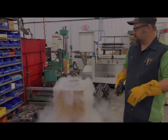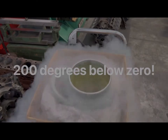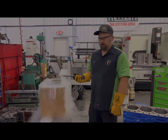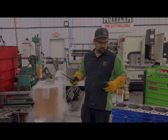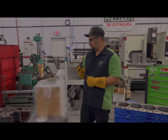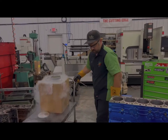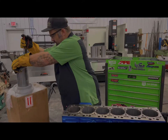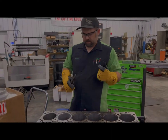When you're taking a room temperature part and putting it in liquid nitrogen, that's about 180 to 200 degrees below zero — that's just the reaction from the temperature difference. But what that's doing the whole time is shrinking the sleeve as much as seven thousandths of an inch. So we've got one to one-and-a-half thousandths press fit, we're shrinking that seven thousandths — do the math, it should drop right in. When it stops bubbling, the temperatures have equalized; pull it out and drop it right in. Safety is key — welding gloves, glasses, pliers — and just like that.